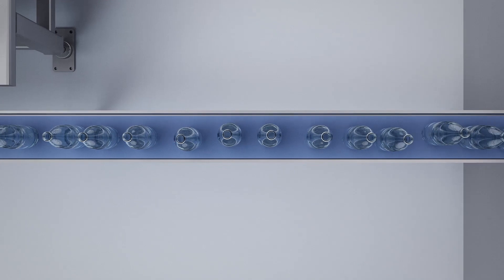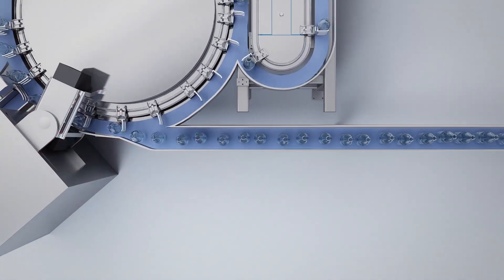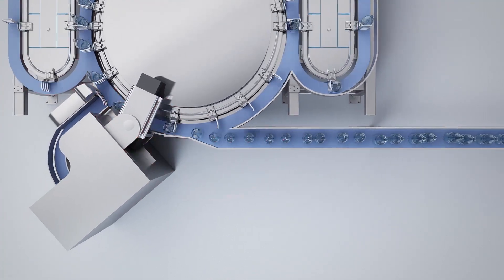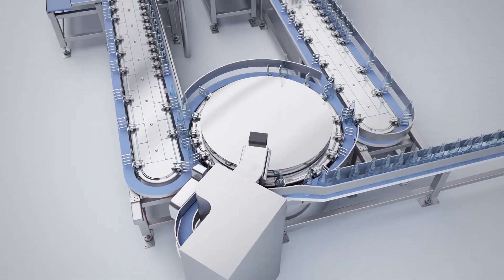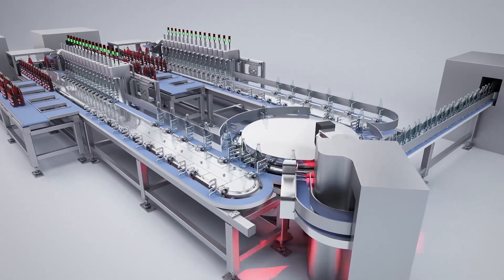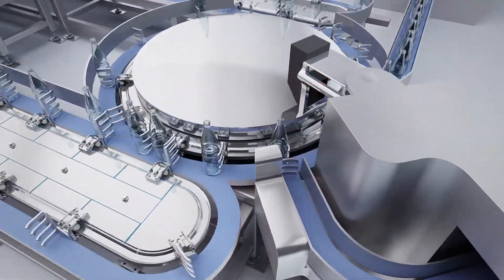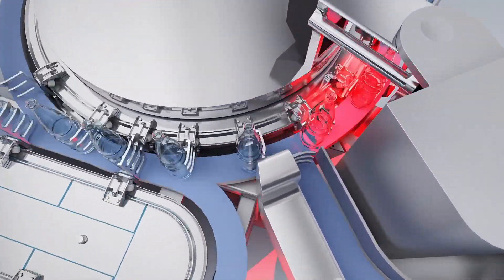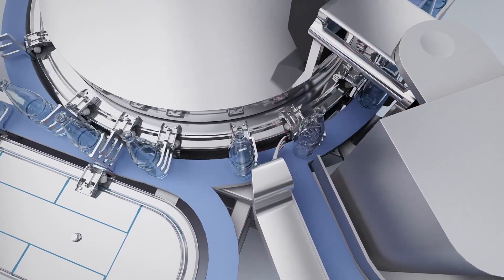The XTS provides a lot of flexibility replacing rotary tables and rotary indexers. When you think about it, you have a fixed pitch on a rotary dial. If I've got it running a certain bottle size and I change my product or my product pitch, I have to mechanically change that dial. Now with the XTS, I can take two movers and those two movers can work together to clamp and grip a bottle and then set whatever flexible pitch you want.